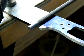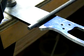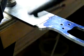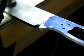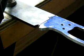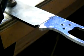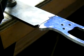Okay, and you can see flat. That's flat. Okay. I don't start flat. I take a black marker, Sharpie, and I color in my cut that I just made. They're all colored in. I'll let that dry for a second. And when I clean my file one more time, make sure there ain't no little metal chunks in there.